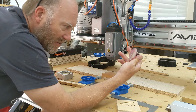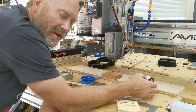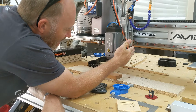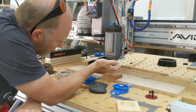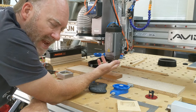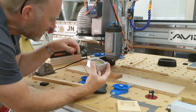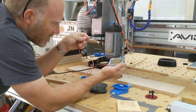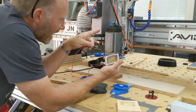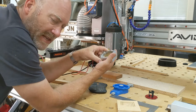In this case I would put my little safety screen back on if I was going to run it, but I'm doing some videoing for another video so I'm going to leave it off so it's visible. A lot of lasers do have a conductive tip, so you can also use the tip for Z, but you can't use the tip for X and Y on this one because it has kind of a conical shape, so it wouldn't pick up the edges accurately. If you're wondering why I didn't have to hook this up — I leave my magnet for my ground connected over on the chassis ground, and my laser is connected electrically to chassis ground, so that makes the connection all the way through. I only have to put the base out here to use.